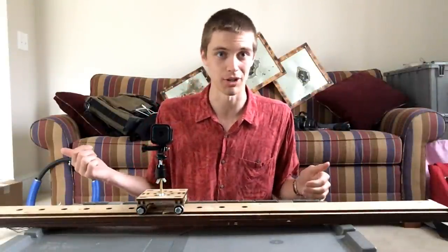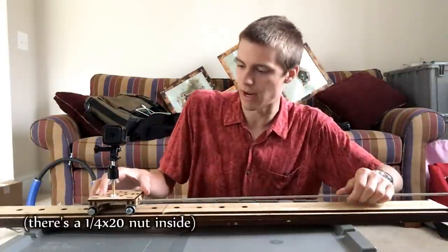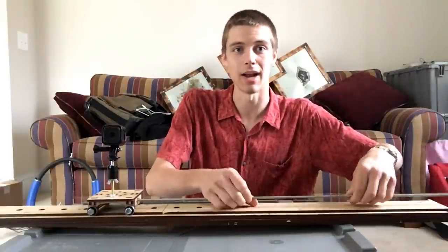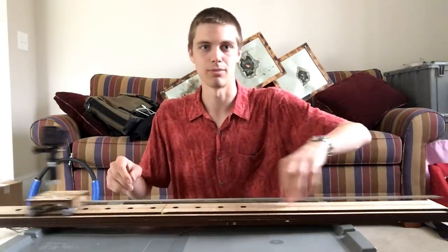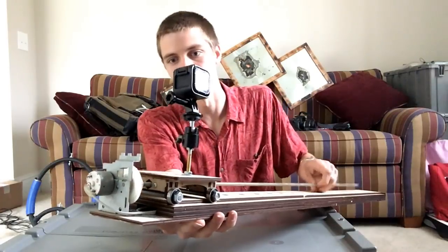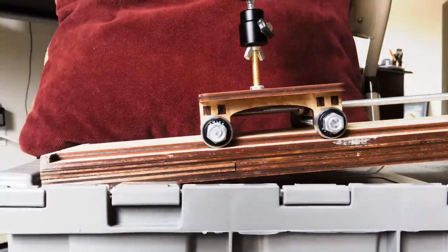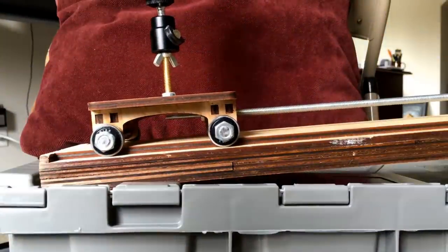The way you drive this is to just stick a threaded rod in and attach it to the motor at the end. The camera is completely fixed and sliding on the bearings without the threaded rod — the threaded rod only drives it. Then you stick the threaded rod into the motor assembly from before and press the button and it goes. The other nice thing about this design is that when the dolly reaches the end of the threaded rod, it just sort of un-chucks itself and falls to the end of the track.